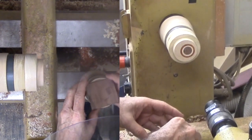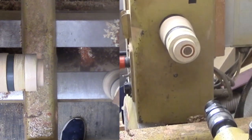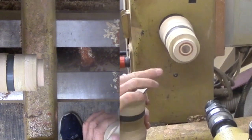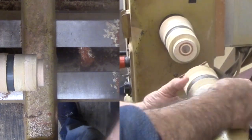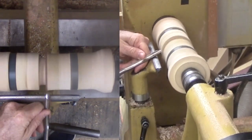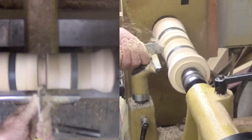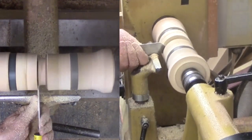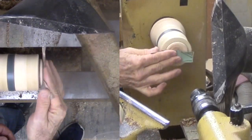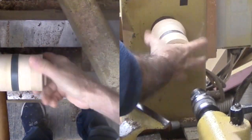This time I will make the sandwich in one operation. I put glue on the walnut backing. Whoops — I almost forgot the final sanding of the faced-off disc. Then I put my sandwich together, making sure no glue wanders over to the double stick tape side. I let this harden at least an hour at this temperature. Once the glue is dry, I can trim the walnut backing and part off the sycamore disk from the original work platform.